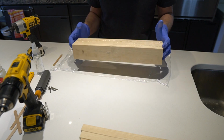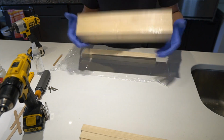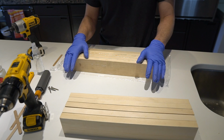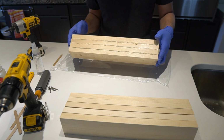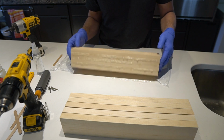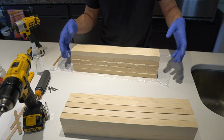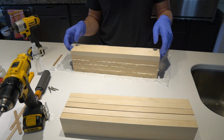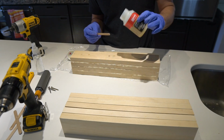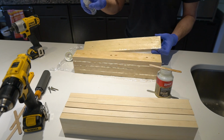All right, I'm in the kitchen because I want to keep the bottom of this cassette that I'm making out of white pine, because white pine's nice and light. I've cut a bunch of pieces here that I've got to glue together to make the cassette. I've done this already for my prone board, but the reason why is because I am having a real hell of a time trying to find dense polyurethane pour foam that is denser than 2 pounds per cubic foot. So I came up with this solution using white pine. It's very light. The density, I think, per cubic foot is anywhere from 16 to the 20s, and it'll be nice and strong. So I'm just going to glue this together. I'm using polyurethane glue. I could use white glue, but I like that the polyurethane glue expands and fills any little voids. And a quick spritz with water just to activate it.